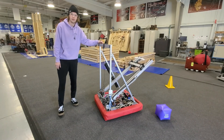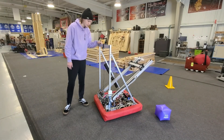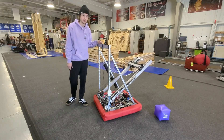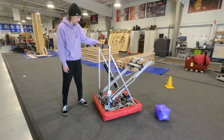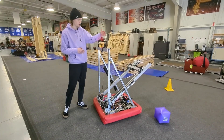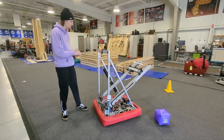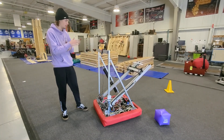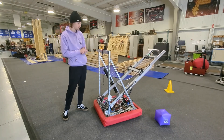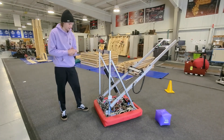Continuing to elaborate on our elevator system — we're using the single stage Thrifty elevator kit, given to us by our sponsor ThriftyBot. We use this to extend out and score cones or cubes onto their mid or high nodes. We actually have presets on the elevator so it's all easily controlled: we have the mid height, then we can go to high, and then we can come all the way back into stowed.